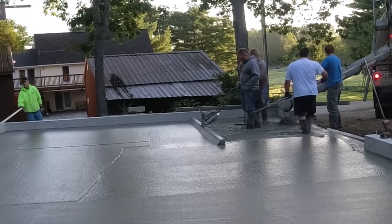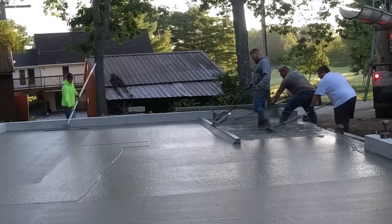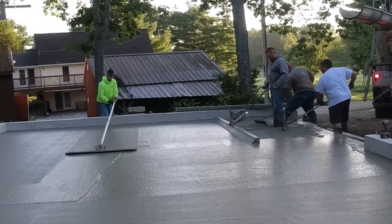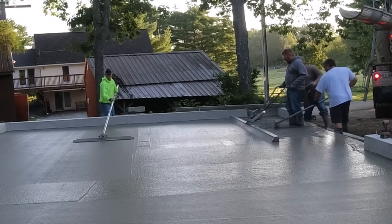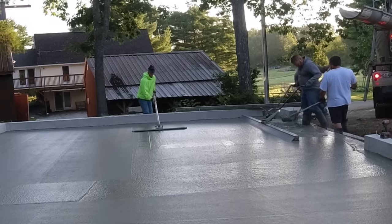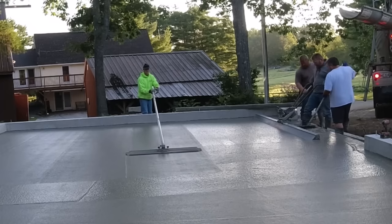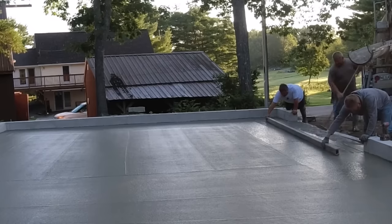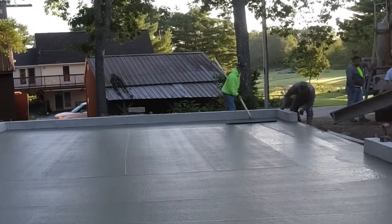Darren's getting right down to the end here. If we're timing this, he's at about seven minutes of screed time now. He's going to finish up at seven minutes and 15 seconds of screed time to do a 36 by 24 garage slab. Let me know in the comments — do you think that's fast, slow, or pretty good? You can see the pace he's going at; he's not going that fast. If we wanted to go fast he probably could have shaved a little time off, but that wasn't the point when we started. When we pull that off, we always like to check the garage doors, make sure it's nice and flat across the doors — we'll use our 14-foot hand screed to do that. Then I'm going to finish up bull floating.